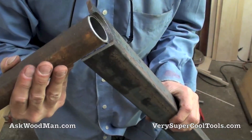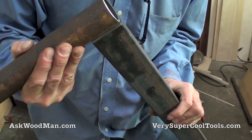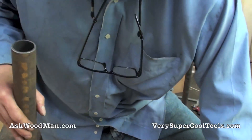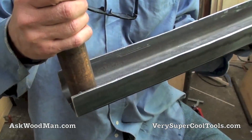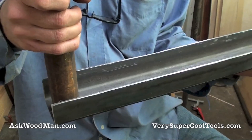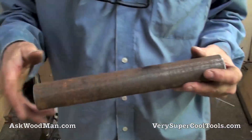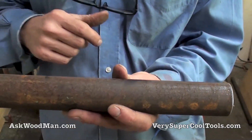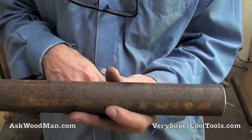The port-a-band already got it right for me, so I'll just clamp this upside down, put it in square, clamp it in place, and weld it on my welding table. The next thing I've got to do is drill through here — I've got my exact distance so it's going to be the exact same centerline distance as on the angle iron, and then these will all get welded together. But before I do that, I'm going to take advantage of the drill press setup I still have going, because I need to drill two 3/8-inch holes in this using the cross-slide table, for my weld nuts and bolts.